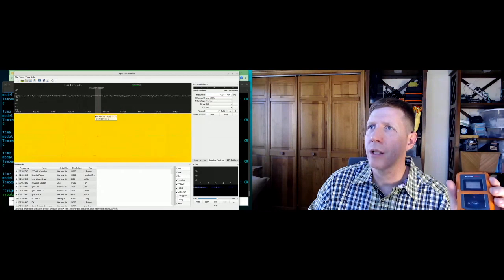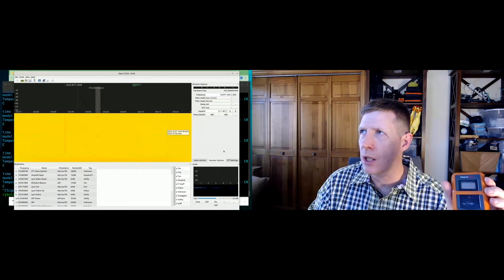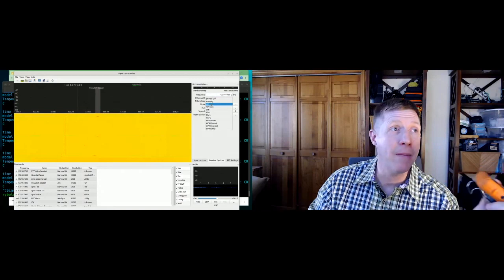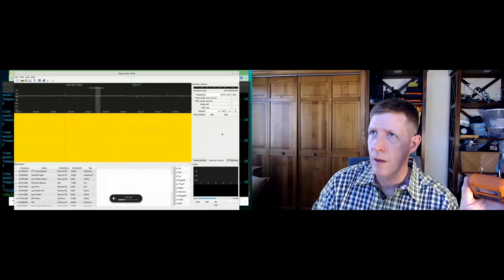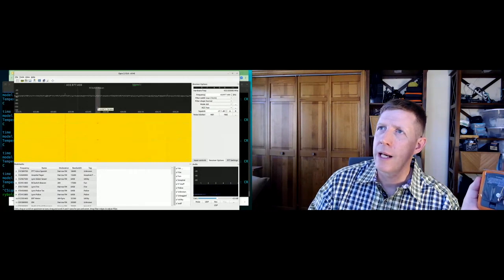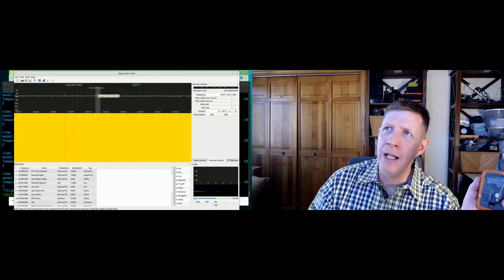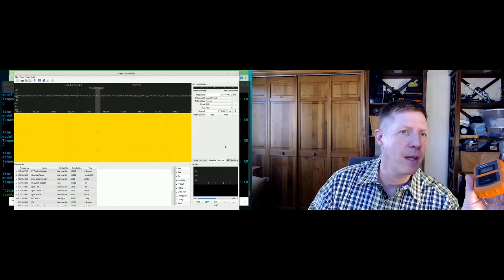Okay, stop processing so I freeze this in the waterfall because it takes a little while. So I'm gonna change my bandwidth to match it, and it grabs it with AM. AM seems to give me a signal. Okay, if I turn my volume up. Got it. And it makes one loud pulse. It's not really spread very wide to the left and the right, and it gives me one solid spike. That is what amplitude modulation looks like.